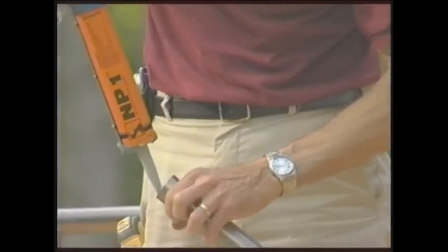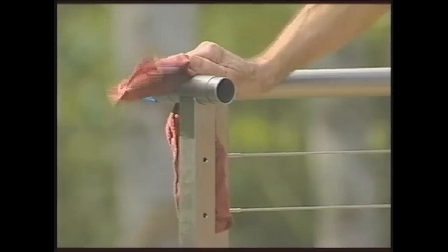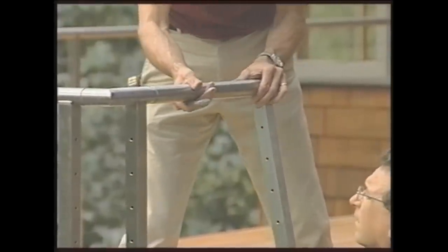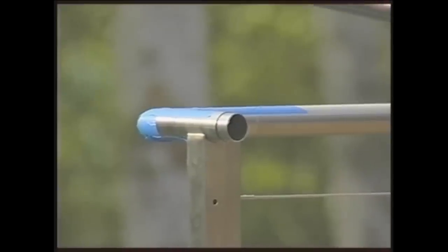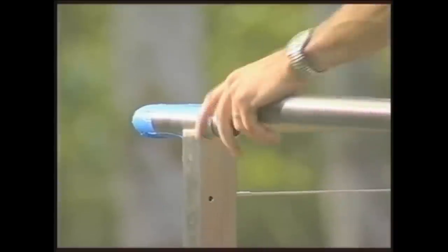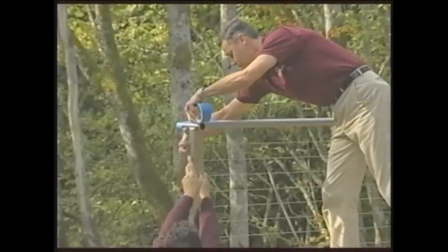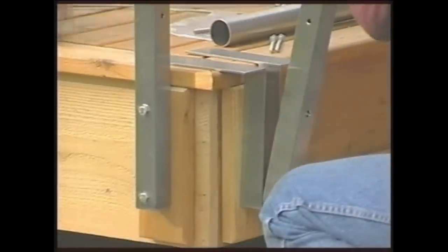Add a bonding agent to the connecting top rail and spread with a stick. Use acetone to clean up any excess. Connect the bonded rail to the post fitting. Set the next post using the same method. Always remember to use the level to check the plumb of each post that is set. You may use tape to hold the connections in place until the bonding agent is fully cured — approximately 24 hours. With the easy hanger as a guide, all you have to worry about is plumbing the connecting posts.